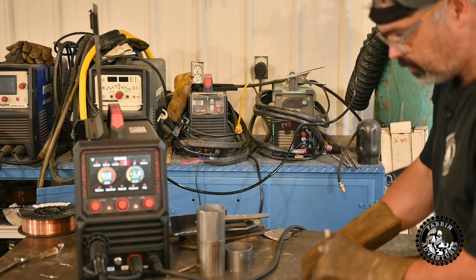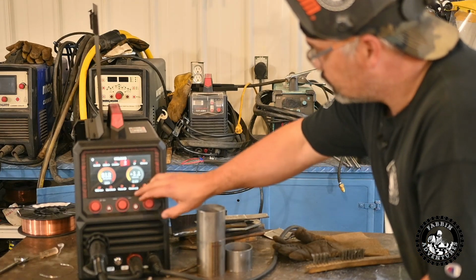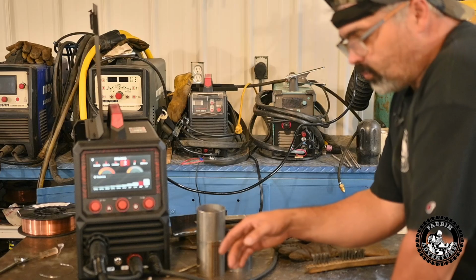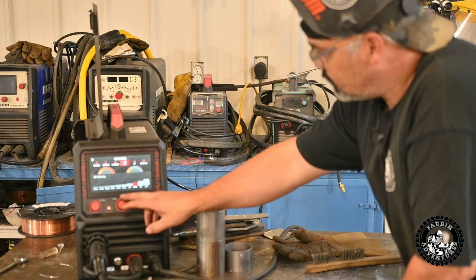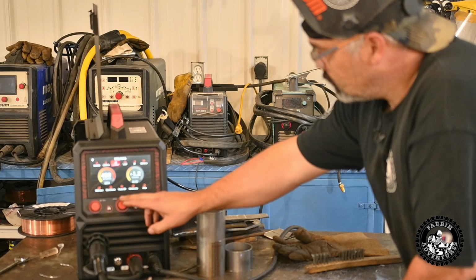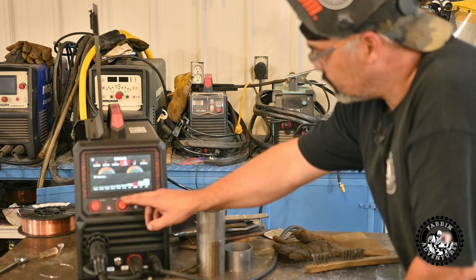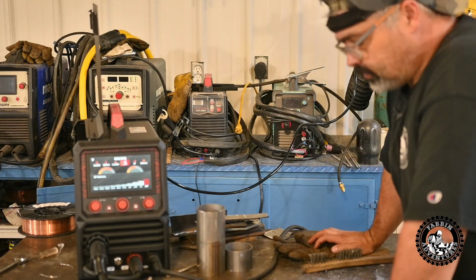Well, we can bump up the juice, but I'm guessing the wire is just going to burn back. Well, let's go and see what it says for 3/8. Maybe we can't get 3/8 with our, oh yeah, see. So we're at max with our wire, with 035 wire. If we had 045 wire, we'd probably get a 3/8 option. Let's see. We'll ramp this up to 045 wire, and then we'll see if we get a 3/8 option. Yeah, we do. So I don't have any 045 wire, so I can't show you welding 3/8.